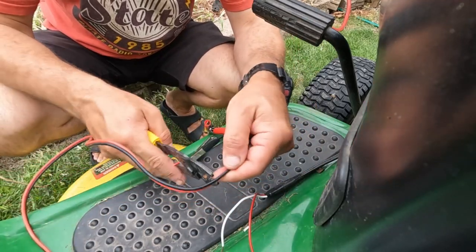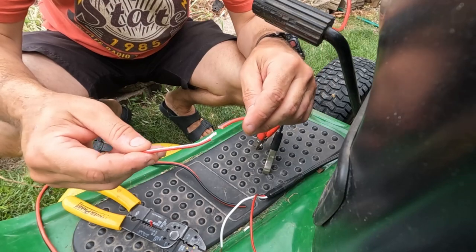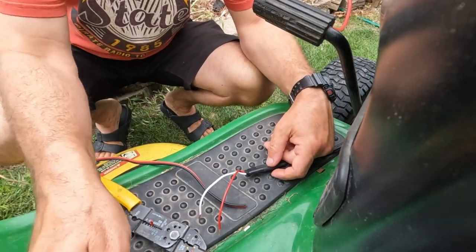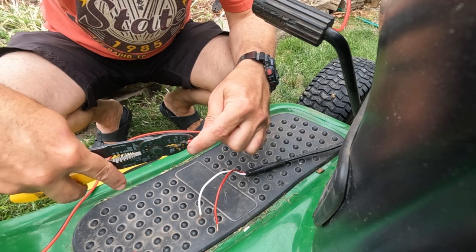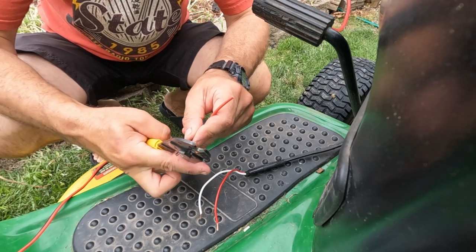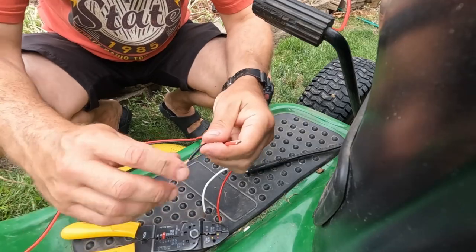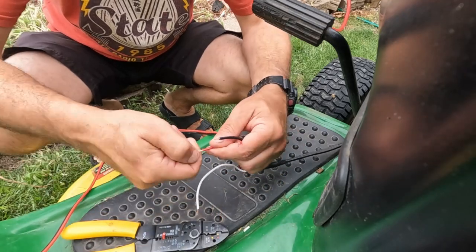This is not really a big deal as far as exact length of what you need stripped. I'm going to take these alligator clips that come on the wire to the sprayer — we're going to snip that off. We don't need much there either. What I'm going to do is connect the other end to this so that we can still use alligator clips if we were using a tractor that didn't have one of these. You never know where it's going to end up, so I've got to make it universal. I'm going to snip these apart and strip these off. I'm going to twist that up a little bit.